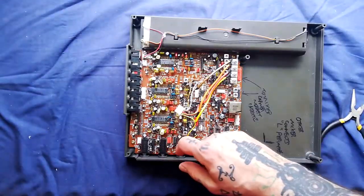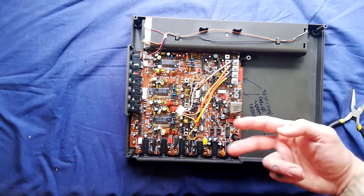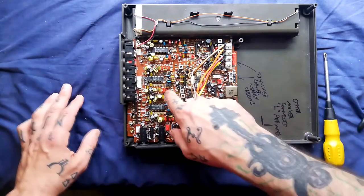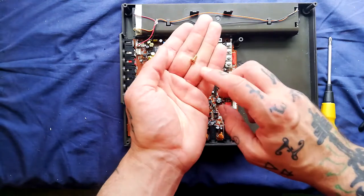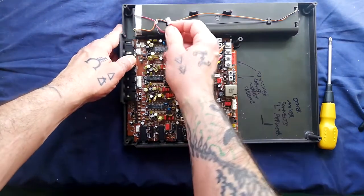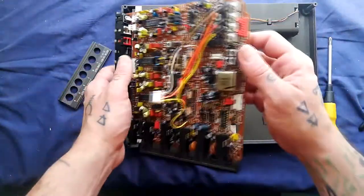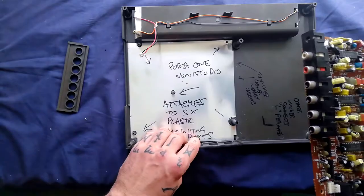Let's go ahead and remove the record playback board from the plastic case — something you might need to do if there are components you want to replace, since you'd need access to the underside of the PCB for soldering. There are five screws: four roughly in the four corners and one near the centre. All five screws are about a centimetre long, brass-coloured with a wide ferrule because they go into plastic mounting posts. Before removing the board you'll also need to disconnect the little two-pin white connector from the header in the top-left corner — that connects the battery compartment to the board. The board will then just lift away; you can see that the plastic surrounds for the various sockets slot into recesses on the lower plastic case.